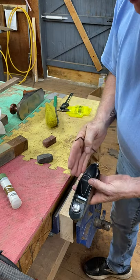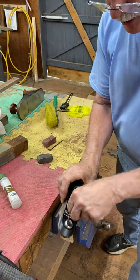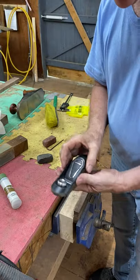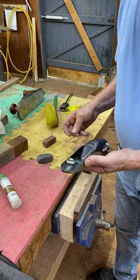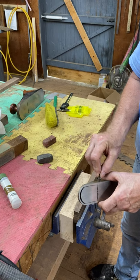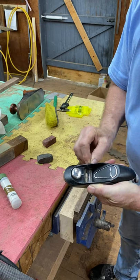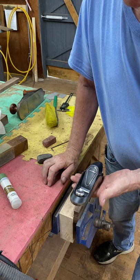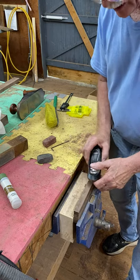Let's do a little practice. I'm cutting a little bit on the left side, and only getting a little bit on the right side, so I want to move the right side in — tilt the blade slightly. With another kind of plane, you'd get a hammer. With a Veritas, I loosen this set screw a quarter turn and tighten this one a quarter turn. That changes the angle of the blade by eight hundredths of a degree. Do you think you can get that with a hammer? I don't think so.